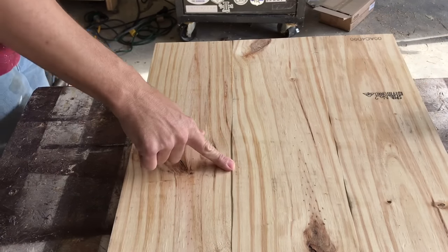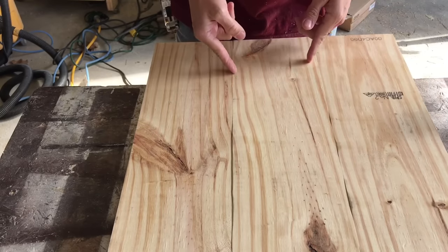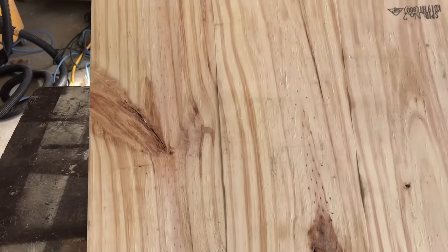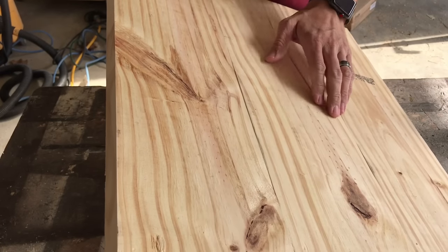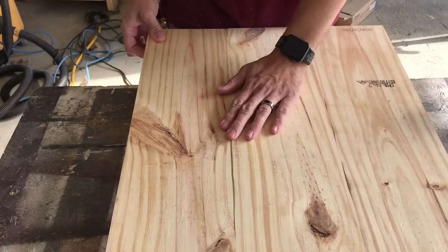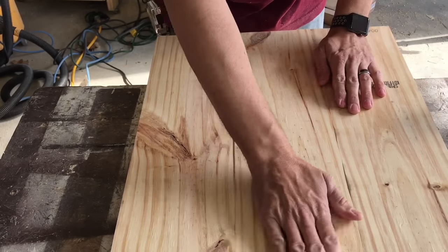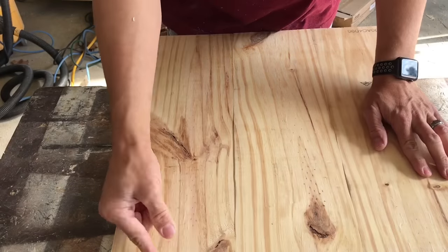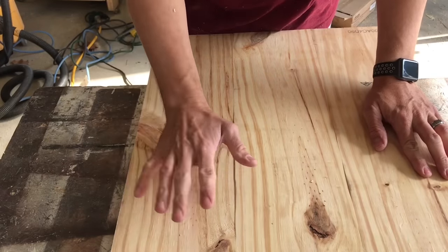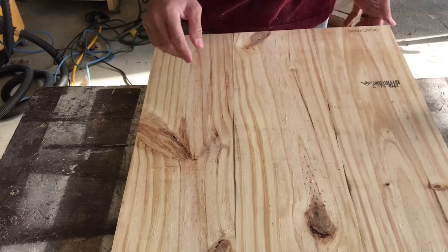Before sanding — the edges lift up a little bit, but the joints are extremely tight with no gaps. What you're seeing is that one board is a little thicker than the one beside it. Since I don't have a planer, I can take a belt sander and sand that joint down as well as the other joint. We'll have two nice tight joints, sand off some of the imperfections, and once this is sanded we're ready to put on some pre-stain conditioner.